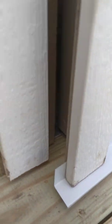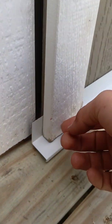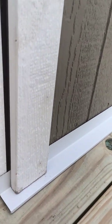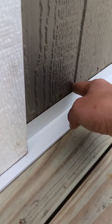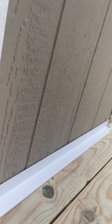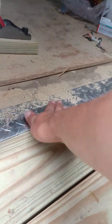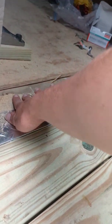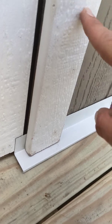I got to go home and grab some stuff, but make sure you caulk this in, pull this board back and pull these nails on the bottom if there are any. And then make sure when you get your bead of silicone in here, you get it in this groove nice and good all the way down, I think this is called T11 or T111, so that you don't get any water leaking down on the inside. I don't want to see any rot in here. This is a level surface, so I don't want water pooling and ending up on our plywood here. It will rot it out eventually. So yeah, that's what you're going to do with a drip edge if that's what you want to do.